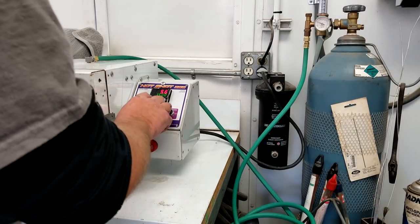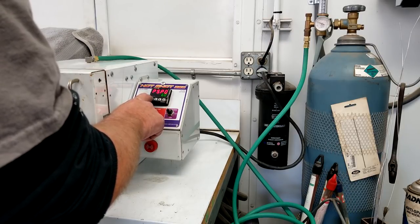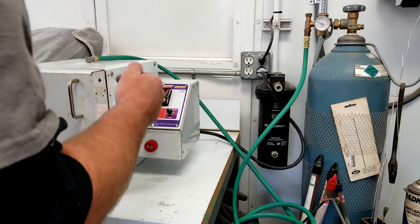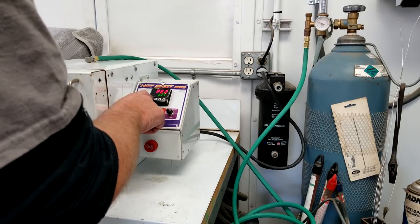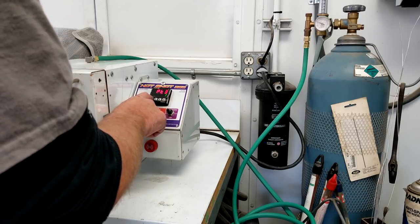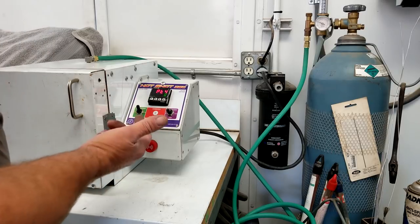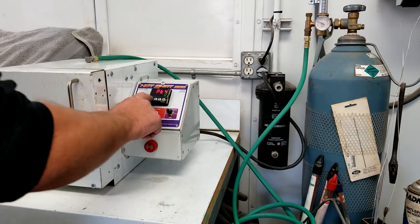Let's check what recipe we had in this oven last. Push and hold P to go to the PTOL menu. Our starting temperature is 60°F. Segment one: 120-minute ramp up from 60 to 1500°F, event off. Segment two: 20-minute soak at 1500°F, event off. Next: 1-minute segment with an A1 alarm sounding at 1500°F. Then time is set to zero to shut the controller down. So that's the recipe for O1 tool steel — 120-minute ramp up, 20-minute soak, alarm, then quench. We're good to go.